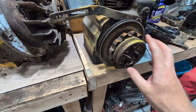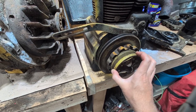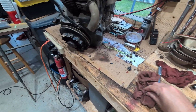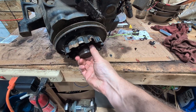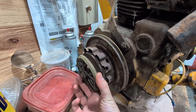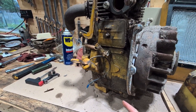I don't think I'm ever going to use the PTO on the tractor. I'm not ever going to put a deck on it. I'd possibly use the thing just for pulling stuff around, maybe putting the plow on the front, but I'm not going to use the deck. So I'm not really concerned. This PTO bearing is like seized on there, so we've got to be able to get that off. For this one this is all seized. I think what I'm going to do is take the bottom of this off real quick and let's just take a look inside there and see what's going on.